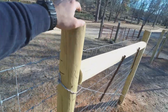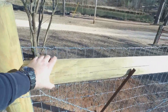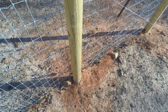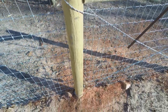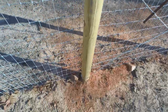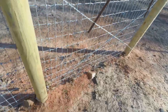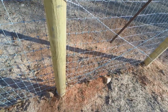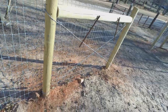I also wanted to mention my main posts. These are eight-foot posts. My brace posts are six-foot posts. For the main posts, I was shooting for anywhere from three to four feet in the ground — three and a half, somewhere around there. Most of these I did go definitely more than three feet. I didn't use concrete. Once you get into this hill, you can see it's red clay. I'm not going to have any problem with these going anywhere. We've had some rain on it and I don't think any concrete was necessary in this case.